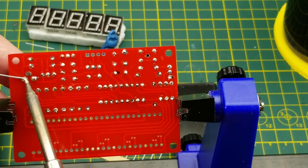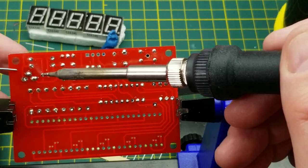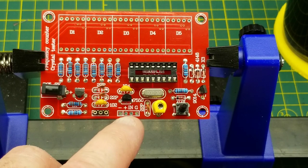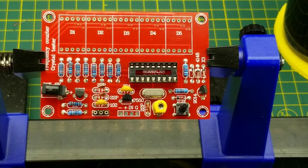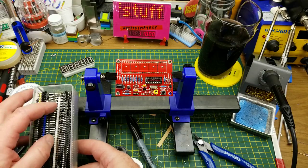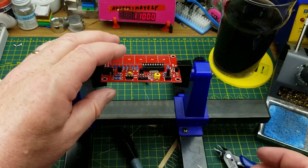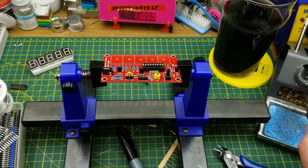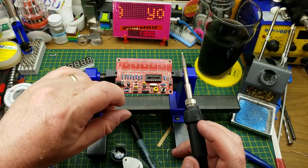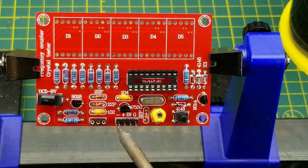The power socket takes a little bit more heat because there's a bit more metal behind it — just linger for an extra second. I should put some header pins on there; there weren't any in the kit, but that's the kind of thing most of us accumulate fairly quickly. Snip off four of those guys — just that easy. I'll try not to burn my fingers again. Is that on there straight? Yes it actually is, cool, and I can still read the legend on the pins.